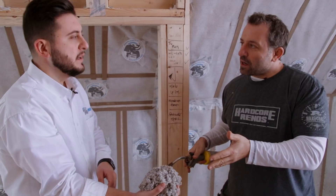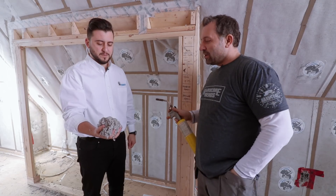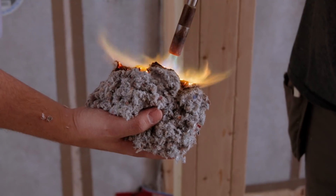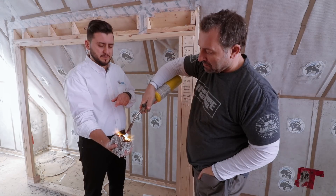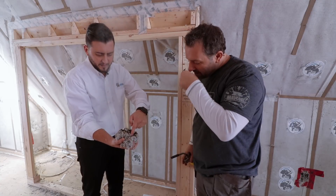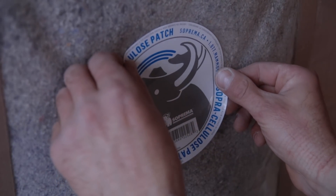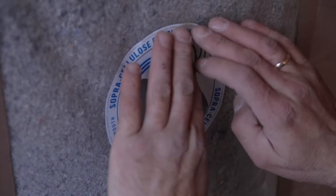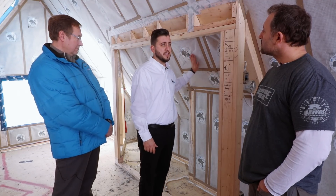This is the actual cellulose product, and we're going to demonstrate how fire resistant it actually is — we're not making crème brûlée here. It's scorching on the top, and you can sit here for minutes, possibly hours. I'm not being shy with this torch — just a little smoldering — and then all you've got to do is just peel it back. Look at that. After injection, the installer will take a roller, roll out any excess air trapped within the cavity of the wall, and apply their patch sticker to close the wall.